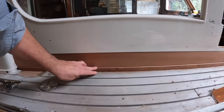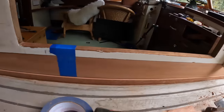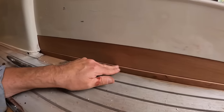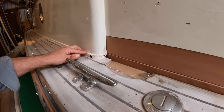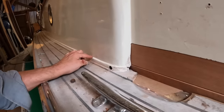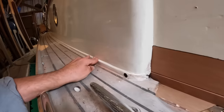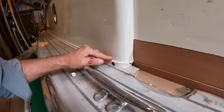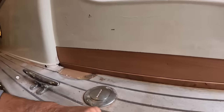Out here I have a very, very uniform joint — very pleased with that. The sill here also needs a little bit of easing on this outer edge so that it matches the sills on the rest of it. I happen to know because I did it that this sill is sealed with 291, then sanded — because it's a sandable sealant — and then painted over. I'll be doing the exact same thing here. This is going okay.